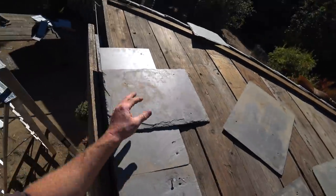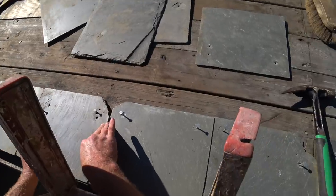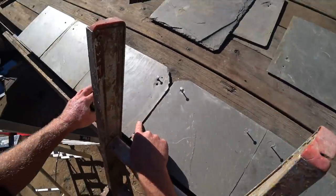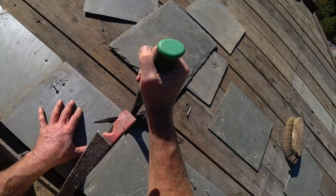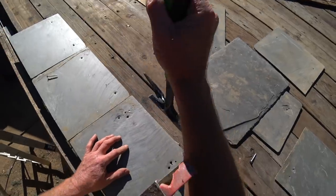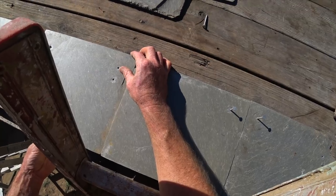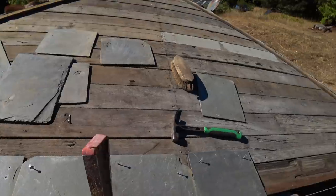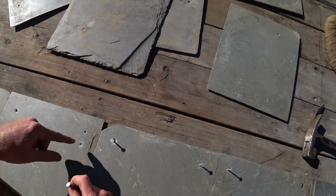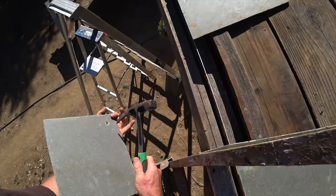This actually already has a high spot here, so it's either gonna be high or this is gonna be very high - maybe it's the slate, maybe it's the wood. You can't pry against the slate like I would have to here. If I pick up a slate I should always ring test it like that to make sure it rings and doesn't sound dull. This hole is right over the crack in the roof, so I'll punch another hole right here.